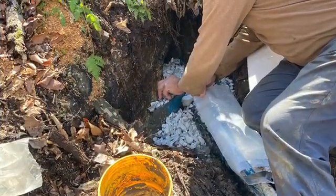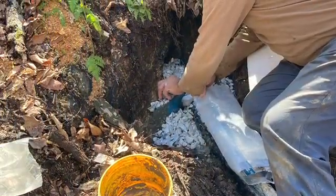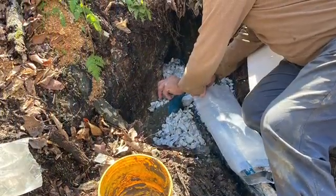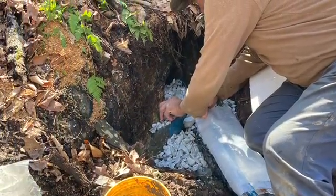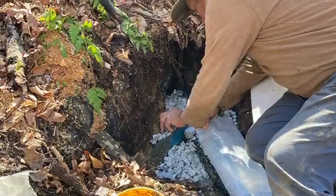We washed the stone out of the bag — this is just marble chips, but anything works. We've completely filled up the dam wall with it. We're actually going to take the stone bag, put it over top of it, anchor it down, and then backfill. Here it is with the dam wall in place, putting a cover on it. You can see in front of the left foot, the black pipe coming out for the line going down to the tank. We're going to take you down and show you the tank build now and putting the pump and the pressure tank all in to complete this whole system.